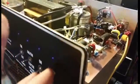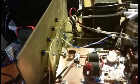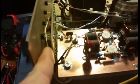We took the whole switch panel out and off, and replaced all your LEDs with blue — not one of the original red LEDs were working. There was also a short in the preamp switch, which is one reason why the preamp wouldn't work properly. The main relay wouldn't engage either. And we had a resistor down here — I think it was a 68-ohm or 62-ohm — it was totally just seared in half, so I threw that in the trash and replaced it with a big five-watt resistor to keep it cool.